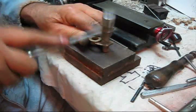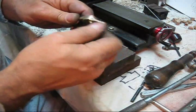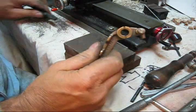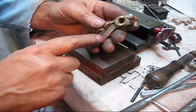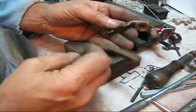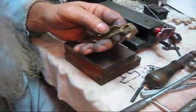If it ain't right, don't pass it - fix it. It had a little burr on it, I felt it with my finger. Now that's better. The little roller rolls and you confirm beforehand that everything is in alignment. A little Maytag trivia: these governor arms are really soft brass or bronze. Some of them will be yellow brass and some will be red brass, but they're really soft. If you get one that's bent or out of line, they're quite easy to put back into plumb.